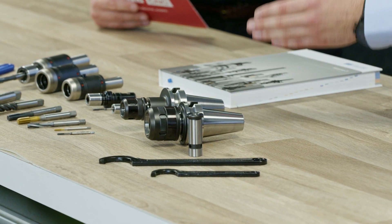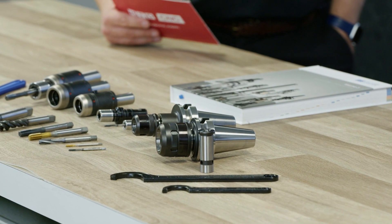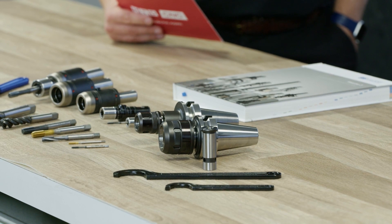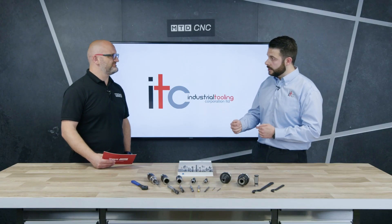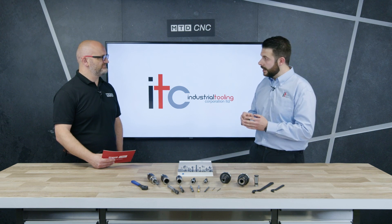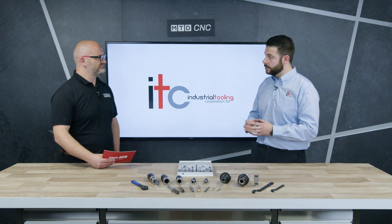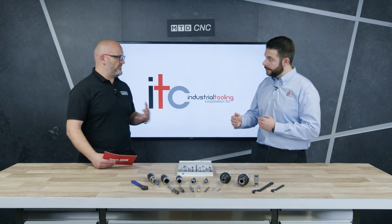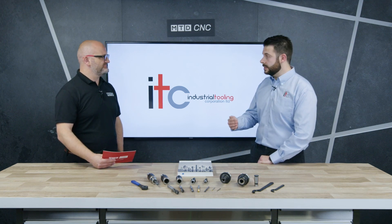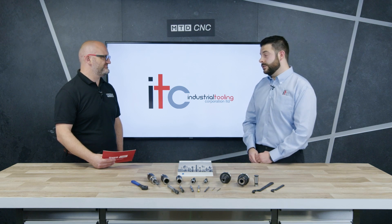Alongside that we have a 12mm, which being slightly smaller and using a smaller tool, it's designed for trochoidal roughing for longer five times D cutters. You need real compression on the tool so it doesn't pull out - there are a lot of forces on the flute. This style of holder really does help prevent pull out on your tool, which obviously you just don't want to be scrapping billets.